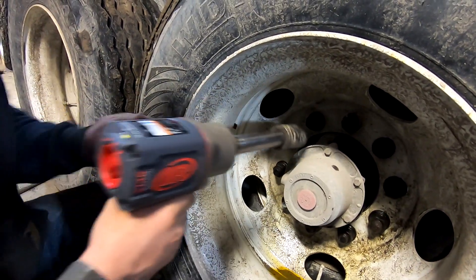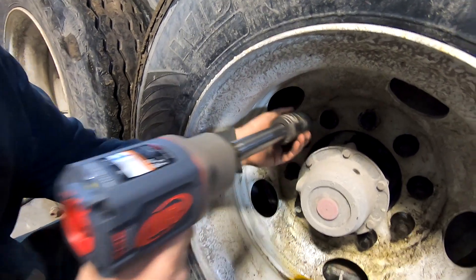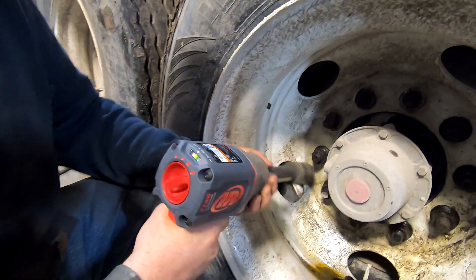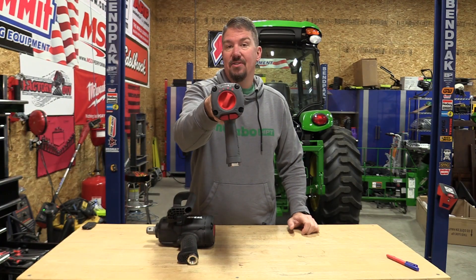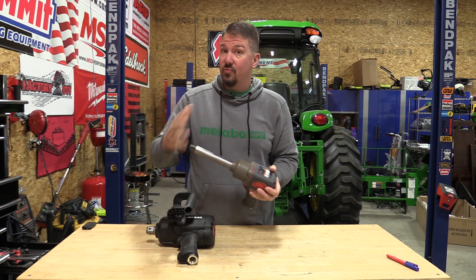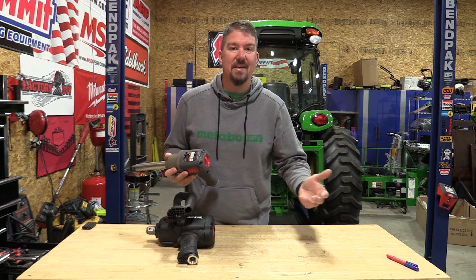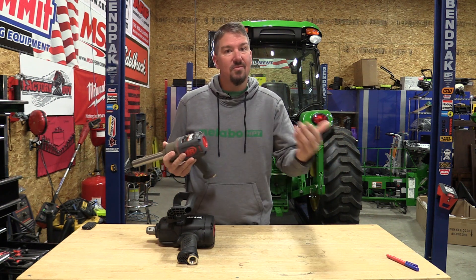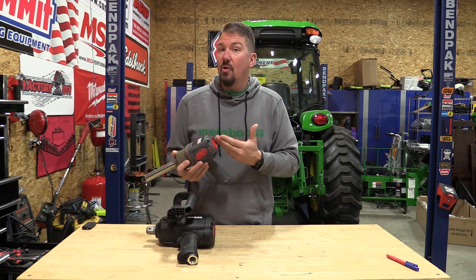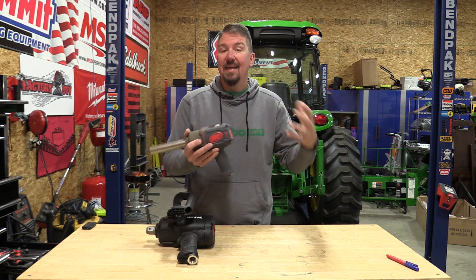She's in the red — absolutely no doubt on the gauge on the back of this tool that we were overpressuring it, completely all the way in the red. That really surprised us because we don't have everything set up too crazy. We have everything regulated to 102 PSI, and then once you hit the tool it should bring some of that pressure down. The hose is quite long but the right size and diameter, and it's still overpressuring this particular tool. Long term that's going to create some damage and maybe make it less quiet.